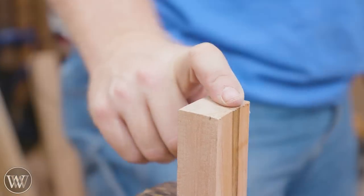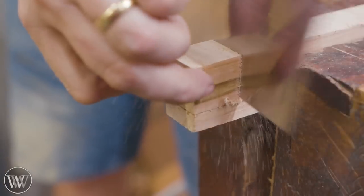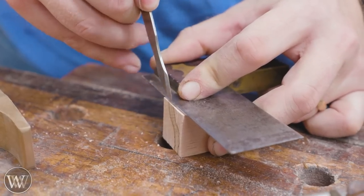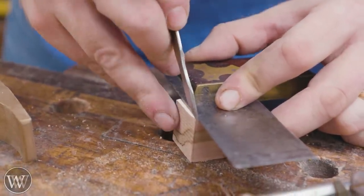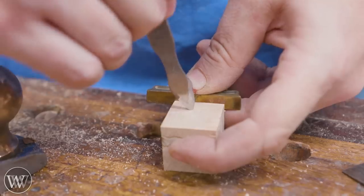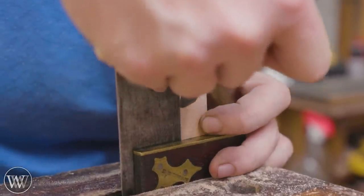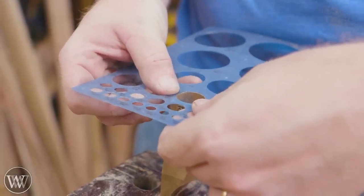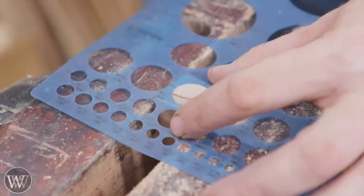Once we have those done, we're going to start working on the face of the large London pattern. This is a wooden face so that it doesn't dent up the plane when you hit it. We're going to cut off a small block that is squared to the same size as the head, plane it down to precisely the same size, and then cut one end off nice and square. I also need to know how deep it is because I want the bottom to touch the bottom of the socket. I'll mark in where that is, square off a line around it, and cut in the shoulder - because it's going to create a round tenon just like the top of the handle. I can find the circle that fits it and draw that out using a circle pattern.